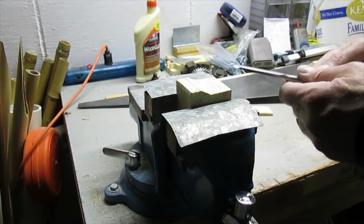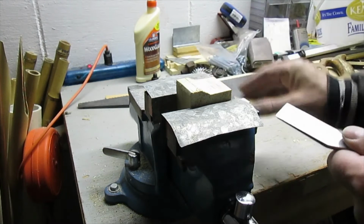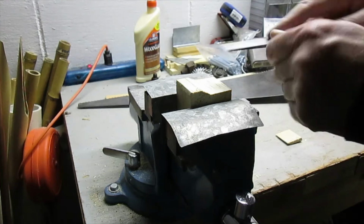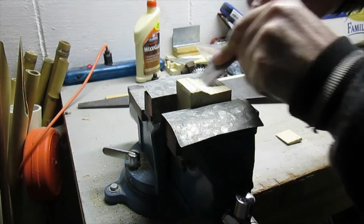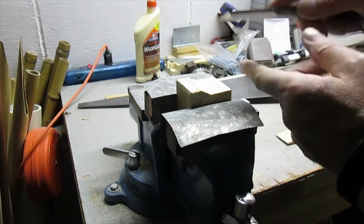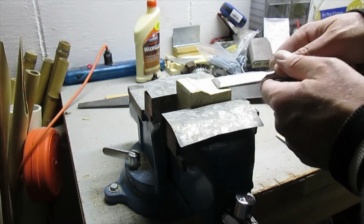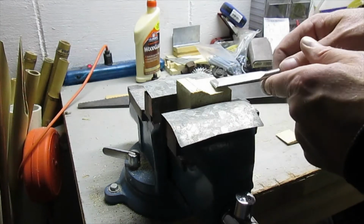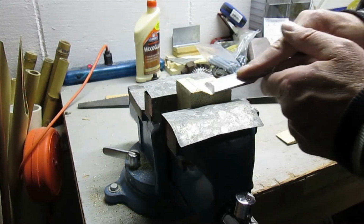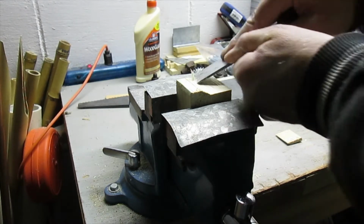So I took my hammer and chisel and removed this piece of wood for the profile that needed to come out. So now I'm just cleaning this up. And I found using a chisel, most of the time I have the bevel down because I have more control. If you have the bevel up, it depends on the wood and what you're doing, a lot of times it'll dig in. Here it's fine, but generally bevel down, you're safer to not dig into the wood.